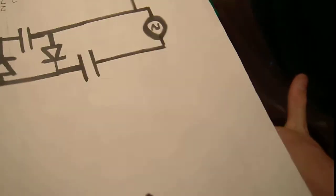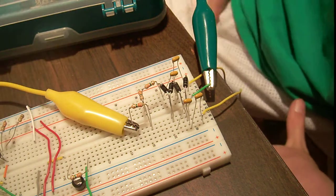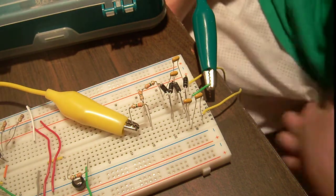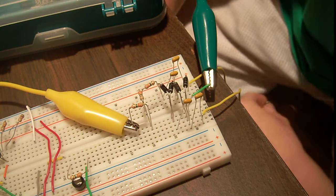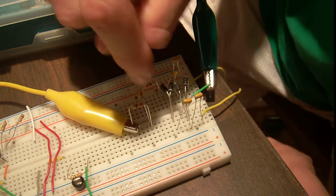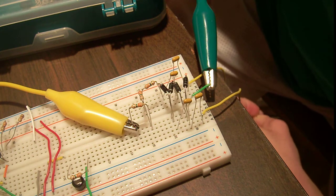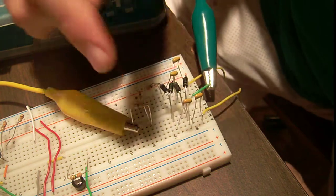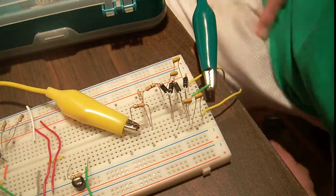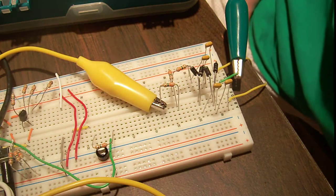So that's all this is. In my case, it's arranged like this, where you have the AC coming in here. As you can see, this is where I'm taking the ground, this is where I'm taking the positive. One thing to note is that my multimeter, when it's on the highest volt range, has about 10 megohms of impedance. So if I put the multimeter directly on the output, it actually loads the voltage — it drops it about 70 or so volts. So what I did is I took a bunch of 3.3 meg resistors — essentially you can think of all three of these resistors as one 10 meg resistor — and hooked it in series. So my multimeter now reads half of the voltage, meaning whatever's on the multimeter, the actual voltage is twice that.